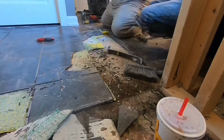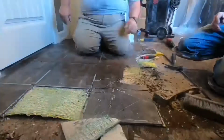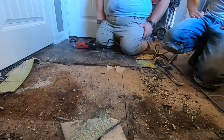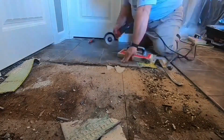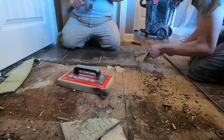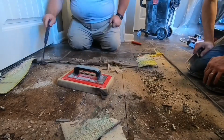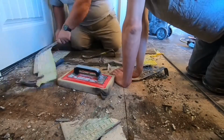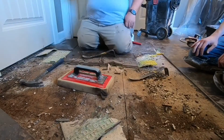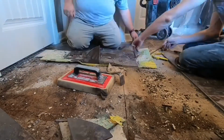The other thing here too on this uncoupling mat we want to point out is that it kind of also traps moisture between the top of the tile and this plywood, and so it just gives the water a place to just run right underneath. When the shower's not built right, it kind of allows that water to just spread. And so it probably made this area outside the shower worse because the shower wasn't done right.